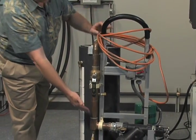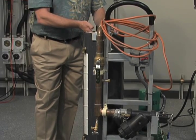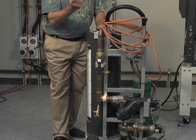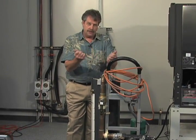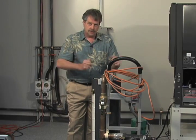On this return side coming back into the tank, we're going down inside the tank about 13 inches. And on the bottom of that 13-inch piece of pipe, we have put a T horizontally so that as the return fluid is coming back carrying some air bubbles, they will shoot to the sides of that tank and start to rise up this vessel and dissipate out.